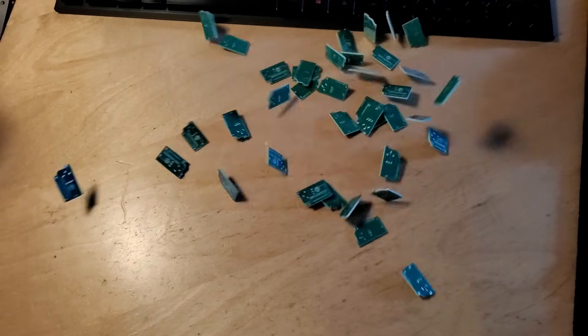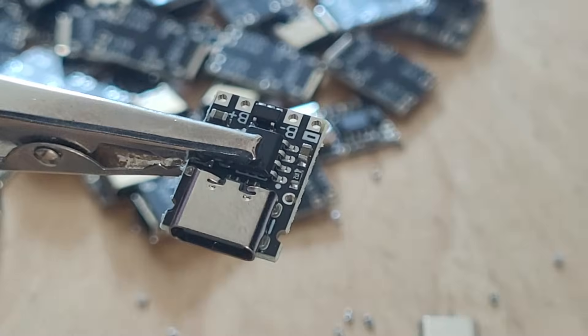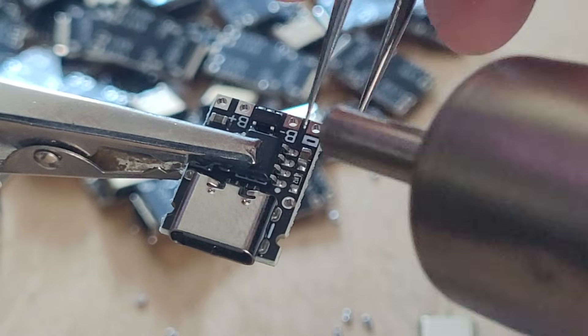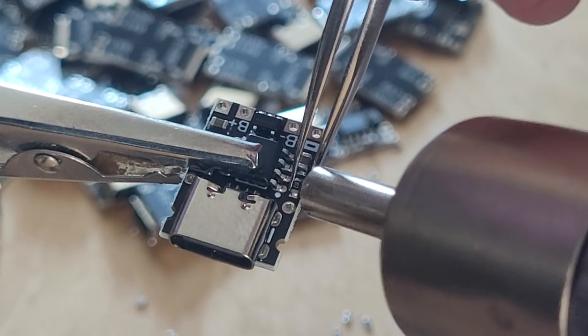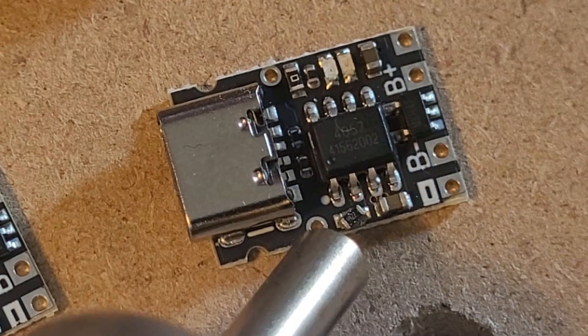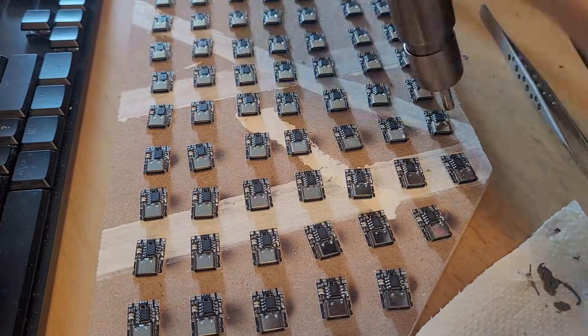This quick fix turned out to not work at all, so there was no way around it — I had to replace the resistor. I bought a hot air station, some soldering paste, and got to work. Every single board sold on my store has the correct resistor, as tested by yours truly. It took some tries, but I managed to get the hang of it. I used a 40kohm resistor for the correct charging current.